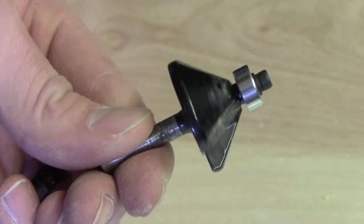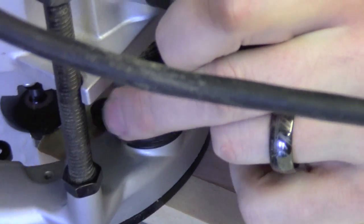I'm just going to take a quarter inch round-over bit and go over all the underneath the sides of the top. Then we're going to take a 45 degree chamfer bit and go over all the upside edges.